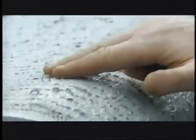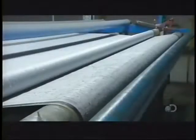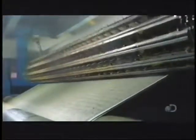The adhesive is a bit gooey at this point and needs to be dried. The dryer is partly open air and partly enclosed — the enclosed section is about 50 meters long and the temperature is carefully controlled, since too hot could melt the synthetic grass. As it exits, hot pins burn holes into the turf to make it water permeable.